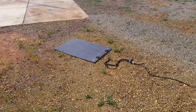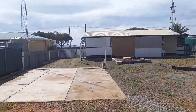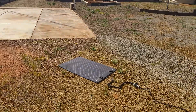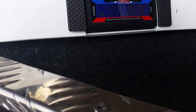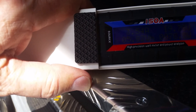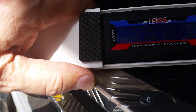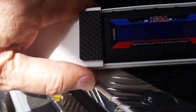We've got the Kings semi-flexible 110 watt panel flat out in the sun. It's about quarter to twelve, a little bit of cloud but the sun is clear. I've got the watt meter amp meter connected and we'll see whether we can get any readings. It reads 4.87, 4.97, 3.83, 2.3 amps, and the voltage seems to be oscillating between 20 volts and 15 — it's going all over the place.